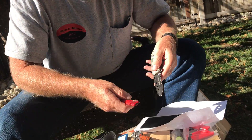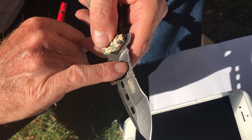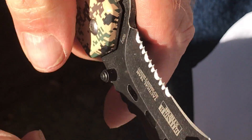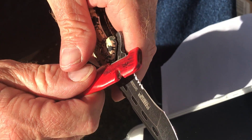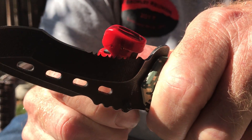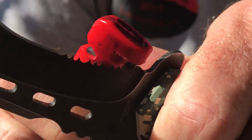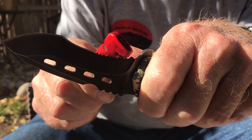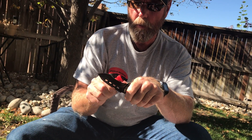We're going to start on the bigger round holes, then do the points, bigger round holes, then the points, and just slide it down through there. You set it back on the left side, slide it right, set it down left, slide it right — right down through there just like this. Then slow down, get the bevel right on the little points, then work the rounded hole.